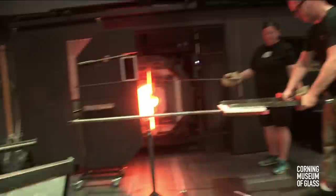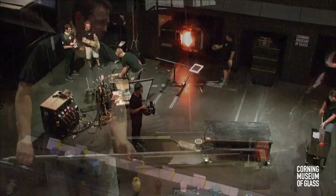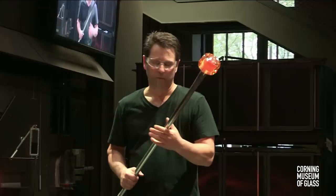So sometimes when you're working the glass, the pipe does get hot. That's a question we get very often: do the tools get hot? Does that pipe get hot? Does the heat crawl up that pipe? Well, yeah, it does. And the longer you work with it, the more that's going to start to creep up there. So you use this tool here. It's called a pipe cooler. It's just a tub of water. There's a bilge pump in there that fills a trough. And you put the pipe in the trough, it cools it right down. Sort of just a fancy bucket of water, really.